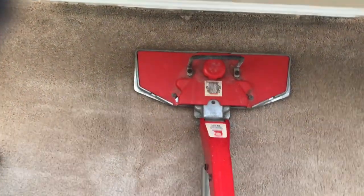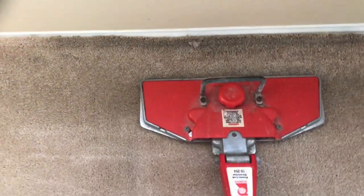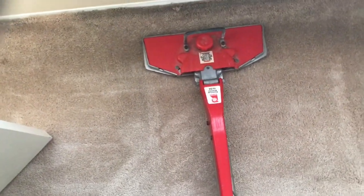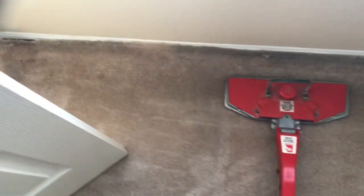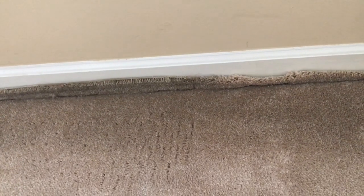We put it on lock and I'm just going to apply some pressure. There we go — got some pressure applied. The wrinkle is slowly but surely moving away. Excess carpet — that's part of your wrinkle. This is what we stretch. We got as much as three inches of carpet up out of here to this point. Then you just take your knife, score it, trim the carpet. Real simple.